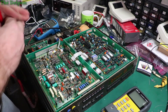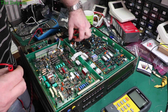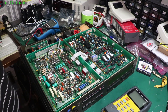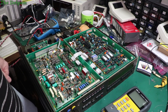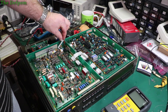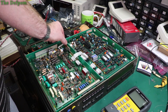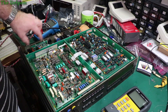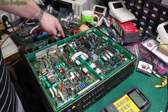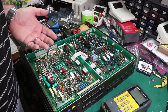As a curiosity, I just unplugged the analog board - that's the power supply to that. In fact I might unplug that one as well. Now we get 6 volts instead of minus 0.9. So maybe the regulator is partially working. I think what happened is because this was off by one pin, it shorted out the regulator. It could also be the board at the back here which is marked as bad, maybe that was shorting out and getting this one hot. It's not actually getting hot, so I don't think it's being overloaded. I think it's just failed.